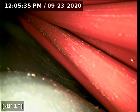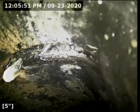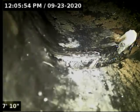All right, we have now moved down to the bottommost cleanout. We're just down below where the air conditioning units are. We're going into a 3-inch ABS cleanout, which will Y into that 4-inch pipe in just a second. And that's the Y connection right there. We've got water running for this one because I think this is going to be a fairly lengthy run, and we'll drain it all out at the end.